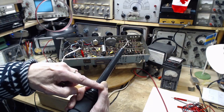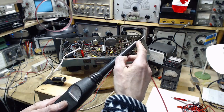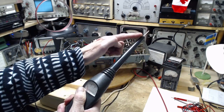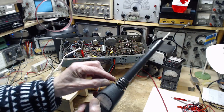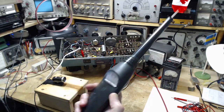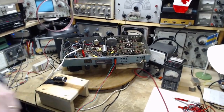It's very hard, but over a surface, not nearly as hard. Surfaces are a big problem. And so, even though the arc can't possibly jump from here to your hand down here, it could potentially track down the surface. So they've increased the surface distance here by making the electricity work its way up and down. You can't imagine it could actually get past all that. That's what's going on with that. How many ohms per volt? No one would care with a meter like this. Again, this is a one single use instrument.